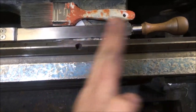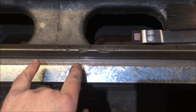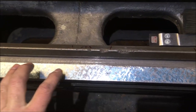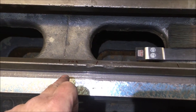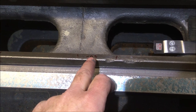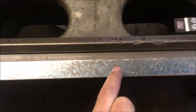And unless the bubble position is moved, everything comes out as zero. So that section showing zero. From this position then to this position, so we're now into the wear thing. So if there was any wear left on this bed section here, i.e. that I've not scraped that down to, it would basically drop this foot, I think. Anyway, I'm showing 0.2 of a division, and one division is 5/10 or 0.5 thou. So if you like, it's 20% of 0.5 thou, call it 1/10, 2/10.